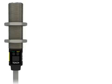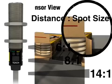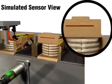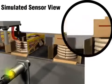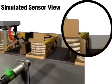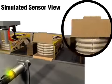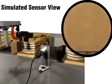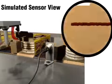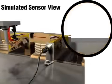The sensor's field of view is calculated using the distance-to-spot-size ratio. Banner offers three ratios: 6 to 1, 8 to 1, and 14 to 1. If the target object is only a small portion of the sensor's field of view, there may not be enough contrast for the sensor to detect the target. If there's not enough thermal contrast between the on and off conditions at a given distance, the best tactic is to move the sensor closer to the target or switch to a sensor with a narrower field of view. This will better isolate the target and increase the contrast between the on and off conditions.